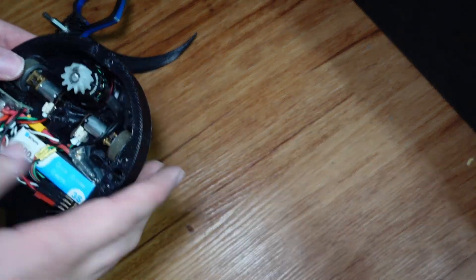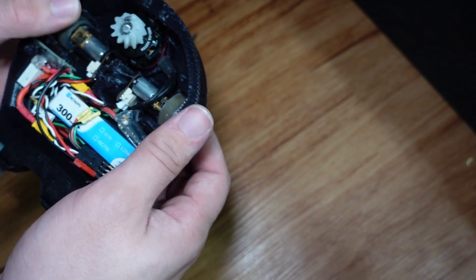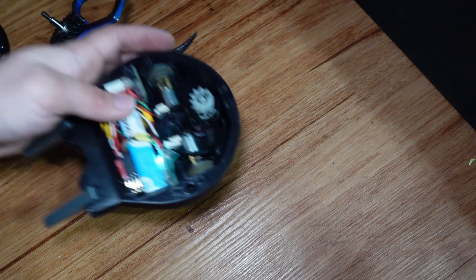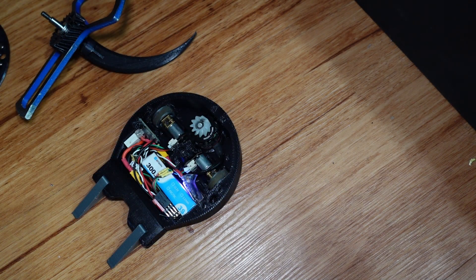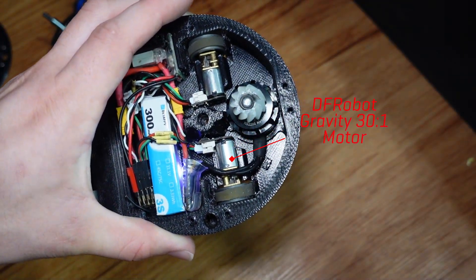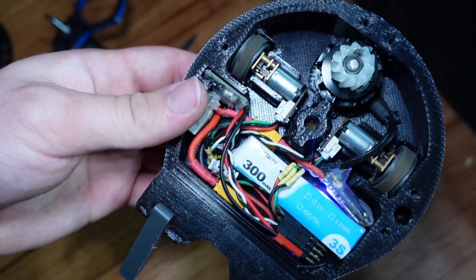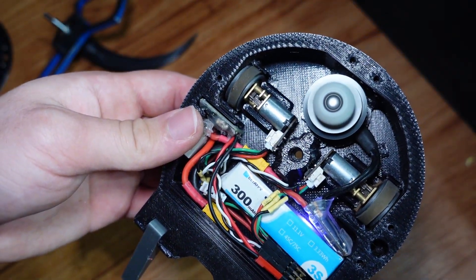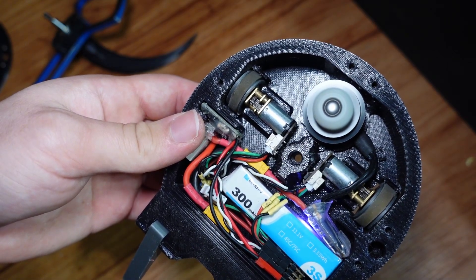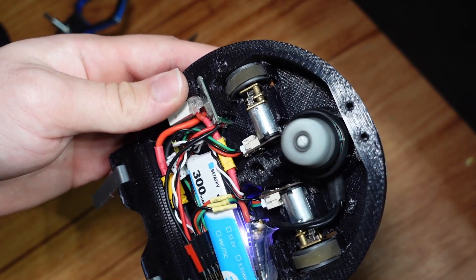The main body of the robot has only two parts: the chassis and the lid. The lid used to be flat, but I had the central shaft support tear out of the bottom from big hits, so now the lid has protrusions to reinforce this integral part. The bot is extremely serviceable with only a handful of screws. The lid is held on with 6 or 8 plastite screws, removing the shoulder bolt for the weapon shaft then provides access to all of the internals. Two screws hold the power switch to the inside, four screws hold the motor underneath, and everything can be swapped to a new chassis in about 10 or 15 minutes.